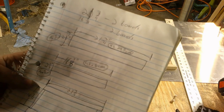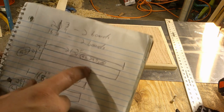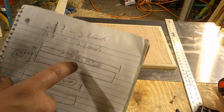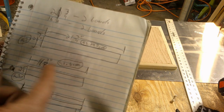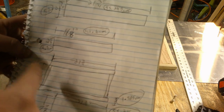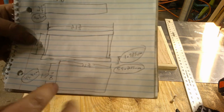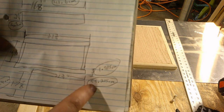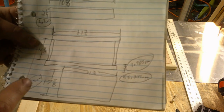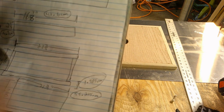I went ahead and drew up my thoughts and measurements. We're going to have two boards at 2 1/4 by 21 3/4 inches, or 5.7 by 55.245 centimeters. We're going to have two boards at 16 3/8 by 2 1/4 inches, or 41.6 by 5.7 centimeters. The whole thing should come out to 21 3/4 by about 17 7/8 once you add on the 3/4 inch overhang from each board. Then I'll have a sheet of plywood on top at 17 7/8 by 21 3/4 inches, or 55.245 by 45.4 centimeters. All boards are 3/4 inch material, or 1.905 centimeters.